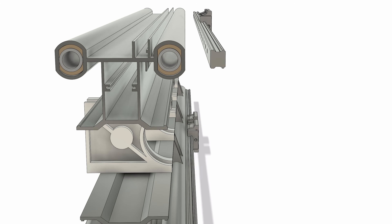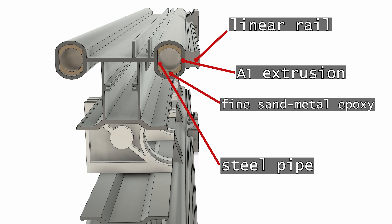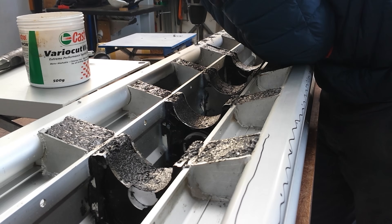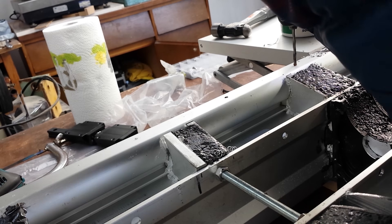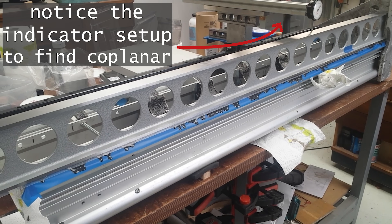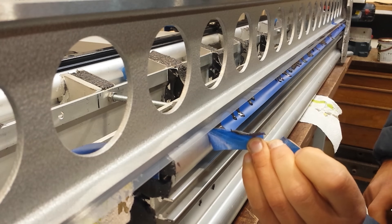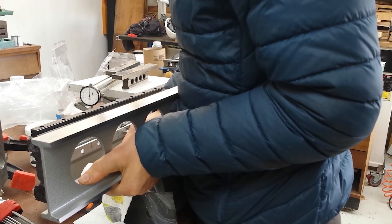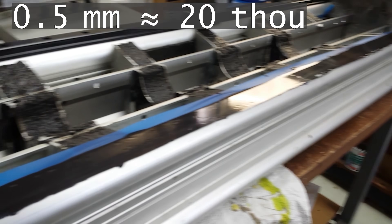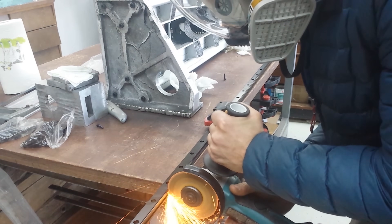The linear rails mount to a surface that's fine sand epoxy sandwiched between aluminium extrusion and steel. Not the easiest to drill and tap, but I'm very excited about how dead it sounds when I hit it with a hammer. Again we're using the process of replication, this time with an engineer's straight edge to get a completely flat surface for the linear rails. The metallised epoxy is approximately 0.5mm at its deepest. As well as being a dead flat surface, it should also give some constrained layer damping action once the steel linear rail is bolted to it.